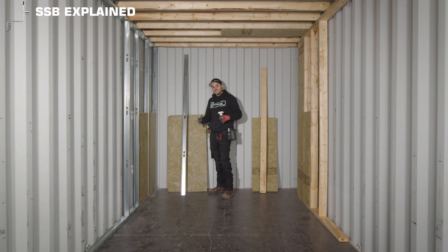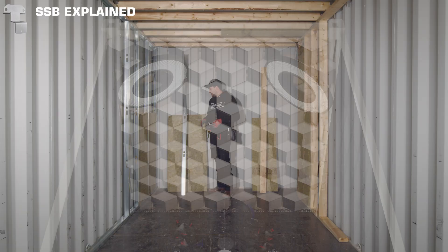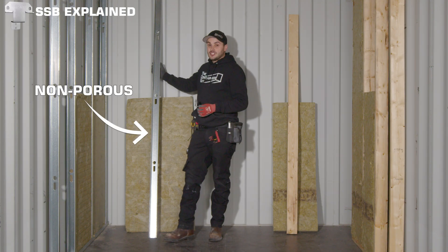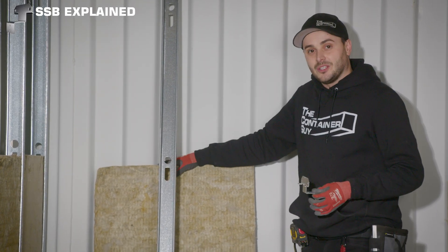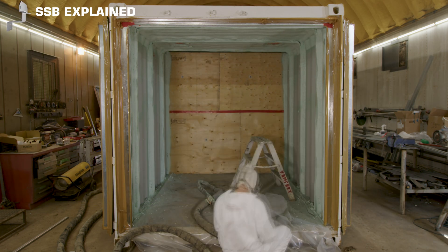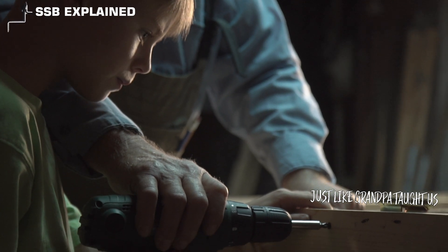That's going to work very well for a soundproofed envelope — so if you were a drummer who needed a place to jam and your parents didn't like you in the basement, it would work very well. And at least, being a non-porous stud with insulation that's resistant to mold and mildew growth, you do have a fighting chance of keeping yourself safe. But again, my ultimate recommendation is two-pound closed-cell spray foam insulation. These are ways you can do it yourself — ways that are familiar to you.